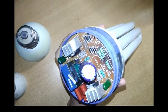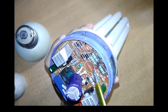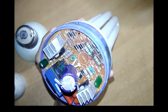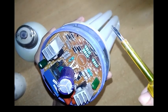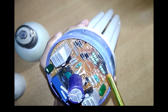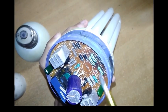Let's see what the components are. Here you can see it has a fuse. You can see a black part here — the circuit is burned because of high heat. It has a fuse because this is an 85-watt bulb. It has a fuse to protect the whole circuit. The fuse protects the circuit from high current. If there is a high current, it will protect the circuit by burning — it has a very thin metal filament inside that will burn due to high temperature. This is called a glass fuse.